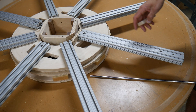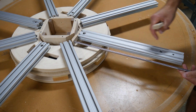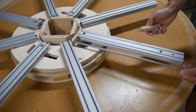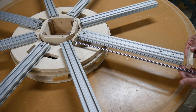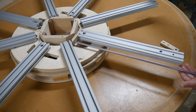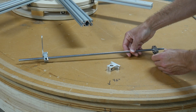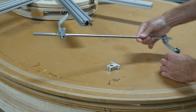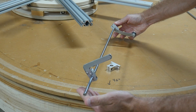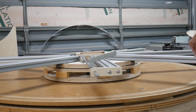The torque tubes are going to be supported by blocks which clamp to the front of the lifting track. Here I'm using an 8mm shaft — I think that should be fine based on some testing, but I do have room to go to 12mm if I need that extra diameter for a good clamp force. On the outside I'll temporarily be using the same style block to hold it up, but eventually that'll sit on the perimeter ring. To speed things up, I reused some existing shaft clamps, simply cut off the tabs, and added on some wings to make these torque tubes. So it'll sit like this, ride up the ramp, and do the lifting that way — quite smooth, reliable lift.